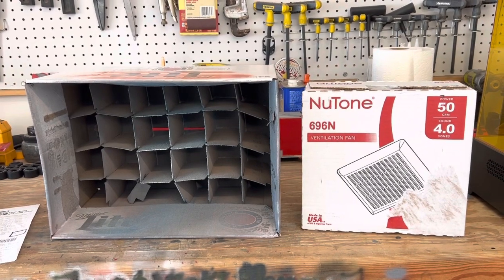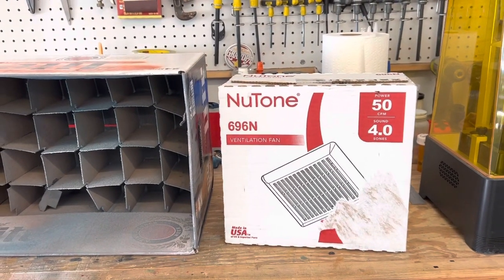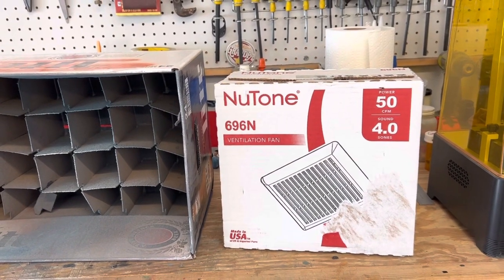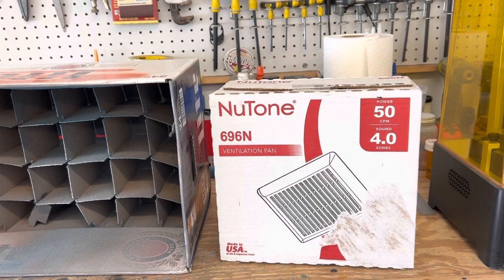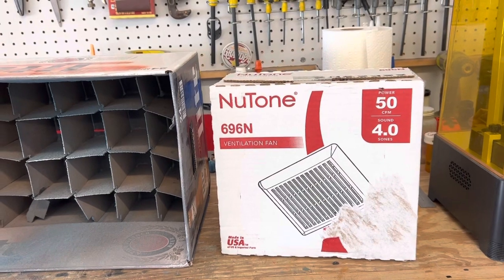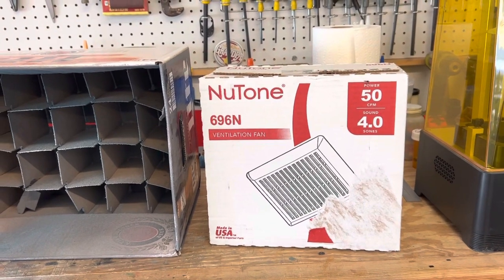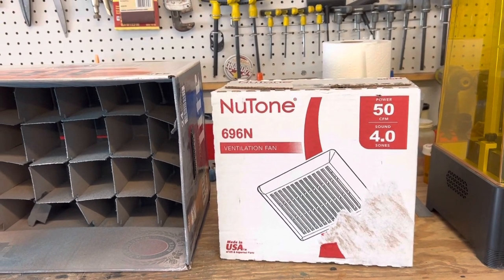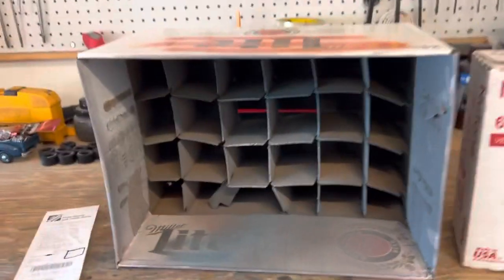I'm 99.9% finished with it and I'm gonna show y'all what I did. I went to my local Home Depot and purchased this bathroom exhaust fan — $21 for this thing. It draws about 50 CFMs, which is rated for roughly a 10 by 10 room — a nominal size bathroom. That pulls the exhaust out of the bathroom, and I'm not dealing with anything quite that large. I built a 24 by 12 paint booth.